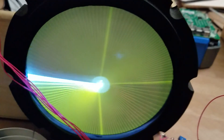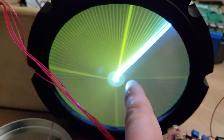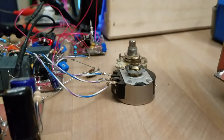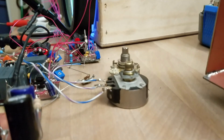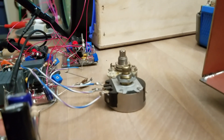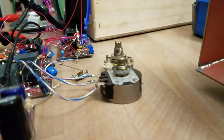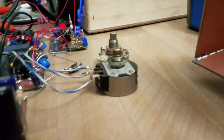As you can see, there are quadrant lines right here, here, here, and here — that's when it's switching from one LED to the other. There's a little gap from where the LEDs transition from one to the other, and that's just because the LEDs have a voltage drop across them, and it has to transfer through zero before the other one will light up.